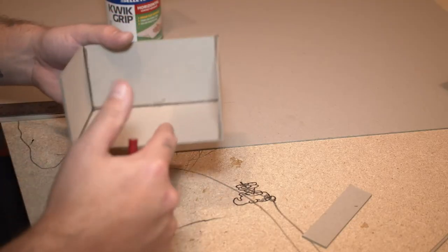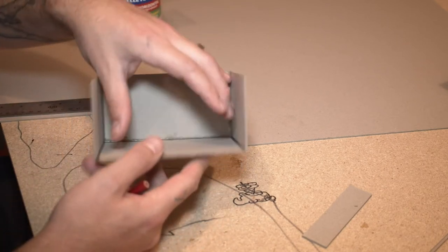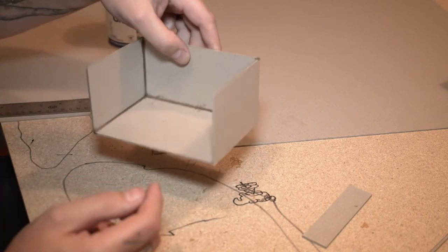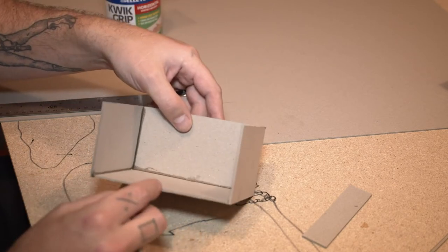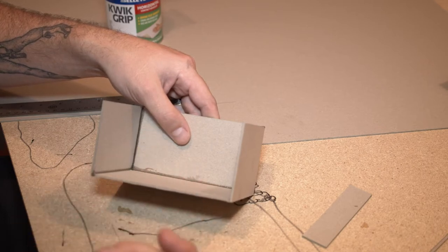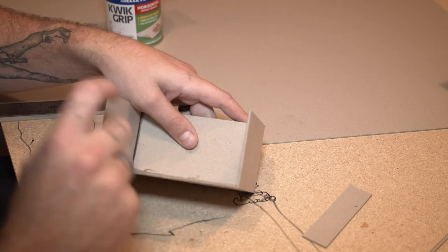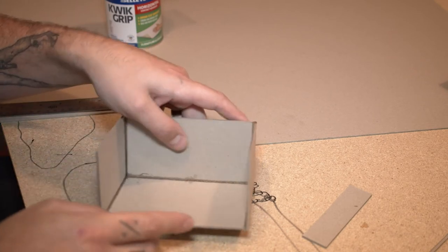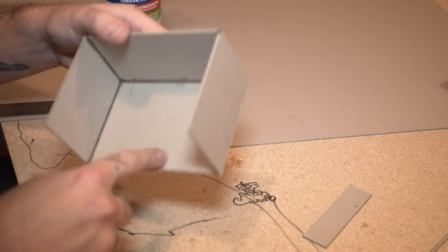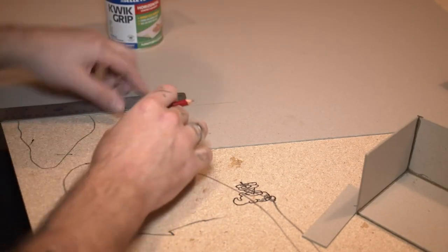Okay, let's get our dividers. This is gonna go in the middle section here, so this will divide the two decks on the bottom and it's also gonna give the support for our upper platform, which our Bakugan will sit on. So, this is gonna be 30 mil high. Our plan said 27 that I drew up at the start, but we're going to make it 30 because we've got a bit more room to play with than I thought. So that'll give us plenty of room for sleeved decks. And we're going to make it 97 long. Would be 100, but because that board's on the back here, it's gonna be 97. So I'll cut them at 100 and then I'll cut that extra excess off just so I can get it precise.